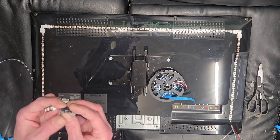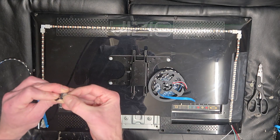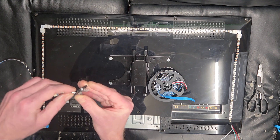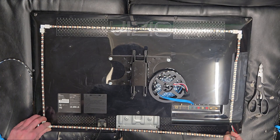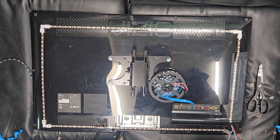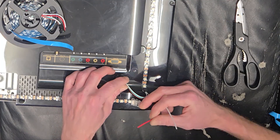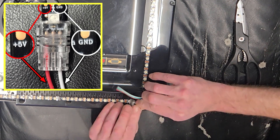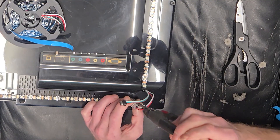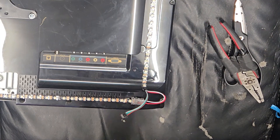When you get this connector, there's a short side and a longer side — the shorter side is for the LED strip. You may have to bend this a little unnaturally back, then line it up so that those pads get punctured, and click it down. We're going to go right over our power cord. Now on the LED strip you've got plus five volts and ground. These two extra wires — we want the red on the plus five volt side, push it in till it stops. The white wire, most importantly, we're skipping the middle wire; we don't need a green data wire on this.